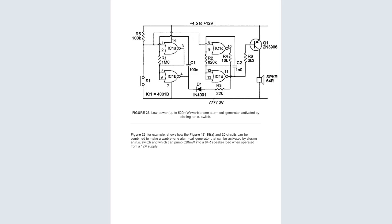Now like these security alarms, say for example somebody has put an alarm or siren in their house or in their car, normally what happens, when it is triggered it rings continuously until someone comes to switch it off, isn't it? So the work of the relay is to hold on, to make sure that after you have pressed or after the circuit has been energized, it still maintains its position until you go to de-energize the circuit again. So I hope that has answered your question.